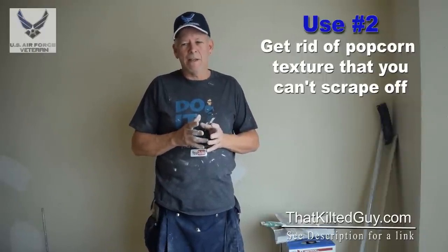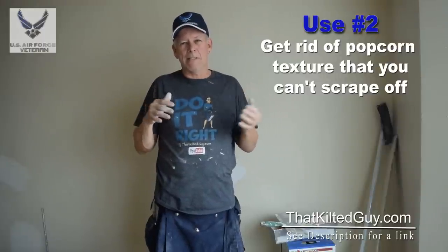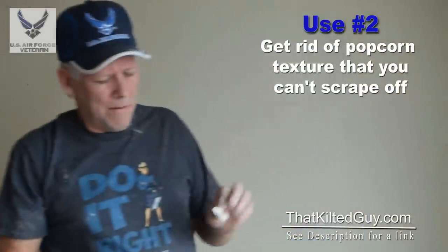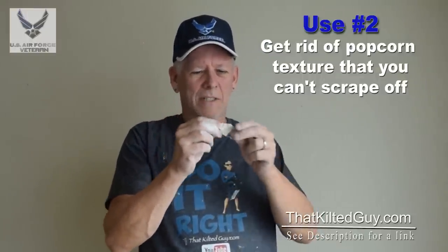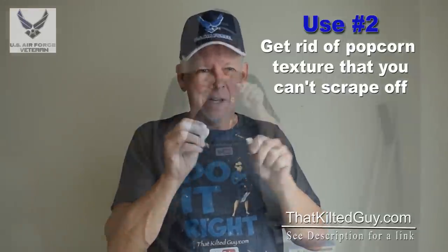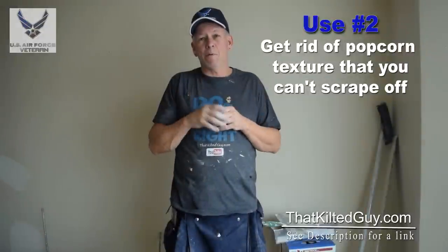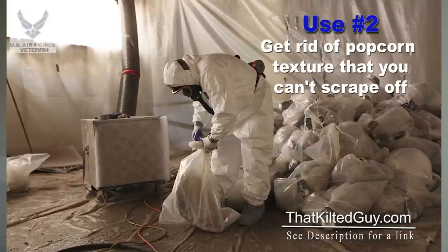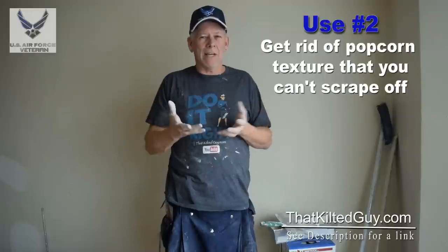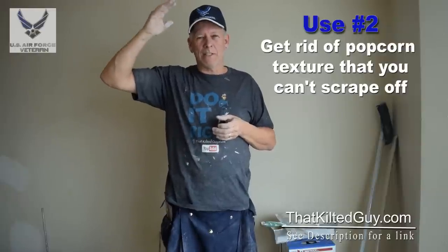To me, that's not my favorite way because it takes an awful lot of mud, and I'm concerned that over the years it may crack more because you've got a continuous layer of mud about an eighth of an inch thick or more — and that's an awful lot to ask it not to ever crack. Mud is pretty brittle. Here's a chunk of some hot mud — it dries a lot harder and more tough, but you see how easy that breaks? If you do have popcorn ceilings with asbestos, you can hire an asbestos abatement crew, but they are really pricey — you might pay five to ten times as much. You can also just put a new layer of sheetrock over it, but either way it's not going to be a cheap option.